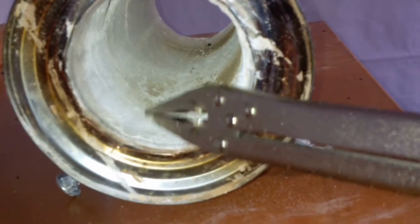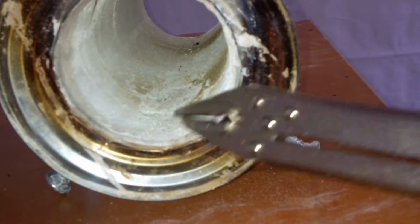This inside is really not durable. It is literally sand and plaster of Paris. You can see there's a bunch of cracks in here. So this one's not going to last long, at least not compared to the last one I made. Any friction at all, it's just wearing that away. I don't think I used enough sand in there. Yeah, I know, I should have measured, and I didn't. I thought, you know, close enough.